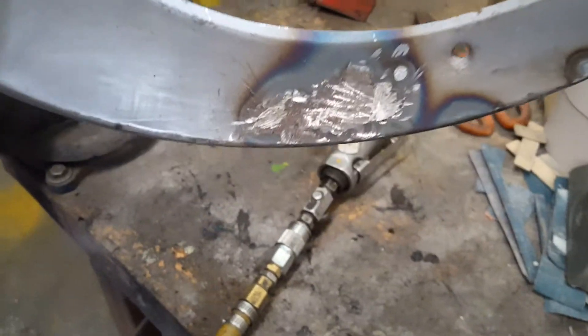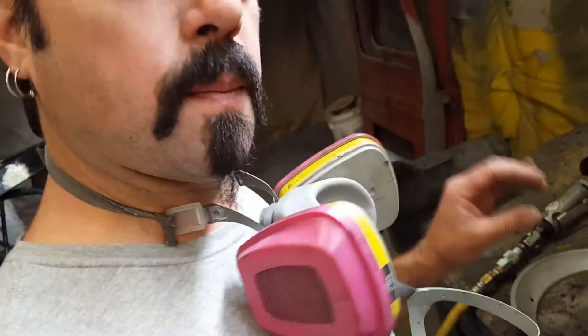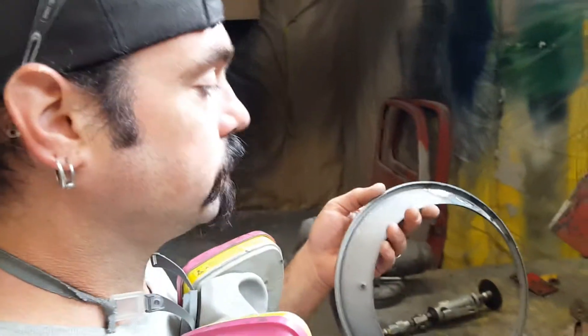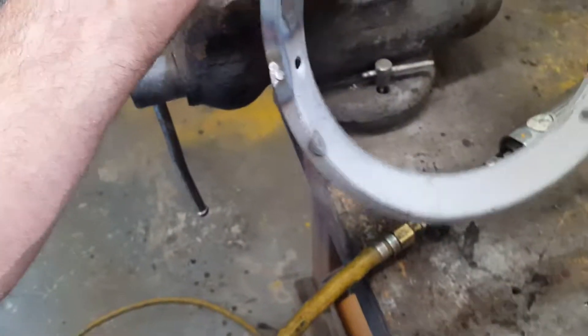This extensive hole I had to weld and fill. What I use is a piece of copper or aluminum — whatever you have, primarily copper — folded and bent to the contour of the radius, and then you weld to the back of that so it builds up your weld. I had to weld it on the front and then on the reverse side. You're going to get a little warpage, but it's very minimal because of the contour lines. You can see how square and straight and true this is now.